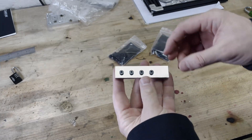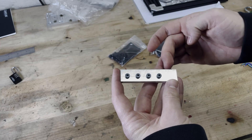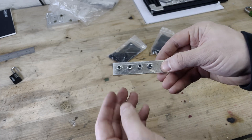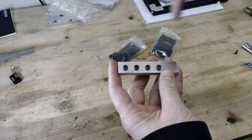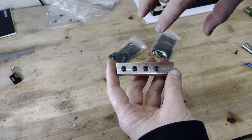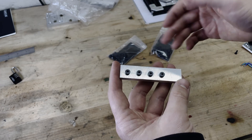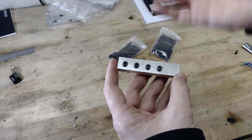This is the fixture I decided on to machine the bolt heads. It's a back plate in which I can screw four bolts at a time. I also countered the bolts because the cutting force of the tool could potentially unscrew them, which would likely mean a broken tool and maybe a broken fixture as well.